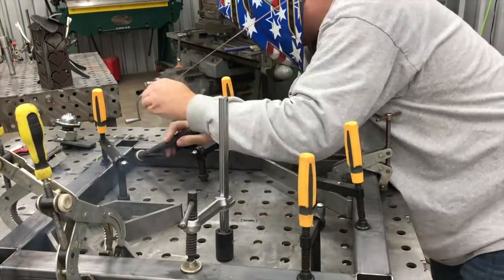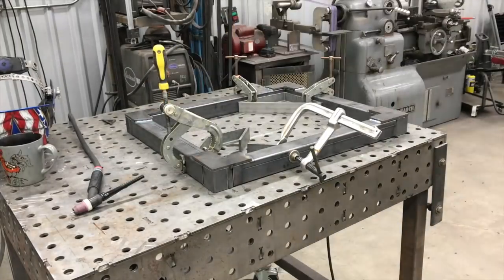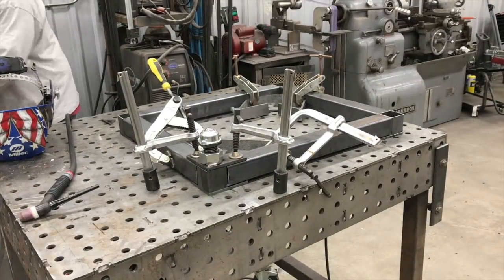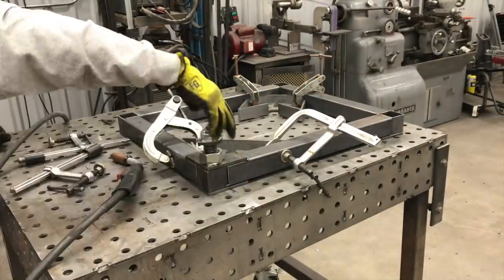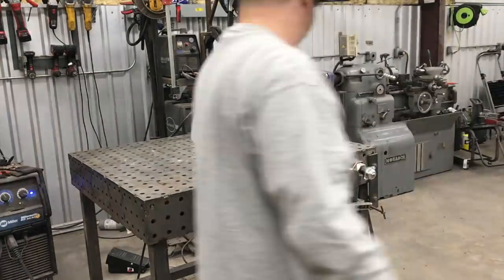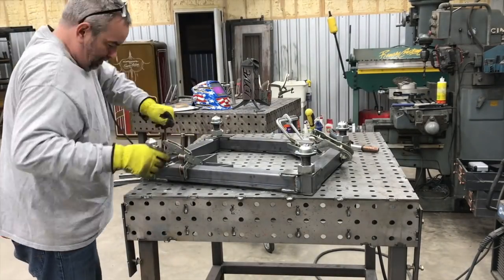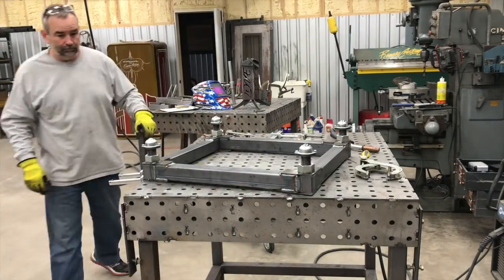Many of the clamps you see being used here — Reed Eichner is not really a sponsor or anything, he's just a friend. He watches all the other YouTubers and machinists out there and he's a great fabricator in his own right. He likes to support a few of the guys he's chosen to support. A lot of times when he buys something new for his shop — which is a really nice shop with a Strong Hand Build Pro table — if he buys new clamps, he'll buy a few extras and send them out to a couple of guys. I've always really appreciated that. You notice early in this I was TIG welding everything, but those little plasma-cut brackets — you can't really weld a plasma edge well with a TIG because it spatters, blows out your tungsten, and you're constantly sharpening your tungsten. So I switched over to the MIG. It's a lot faster and does a really quick job on this kind of stuff.